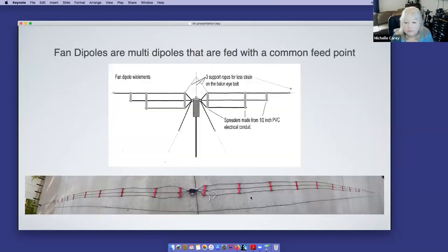I made one two years ago. You can see my spacers and the balun I bought — not one I made. This is a 20/40/80 antenna. You'll have to pick what bands you want. It's so easy to make — it was unbelievable. You hear stories about ham radio being expensive, but this antenna was under a hundred dollars. We used it at the SCARS field day two years ago for the go-to station and people were making contacts all over the United States, Canada, and Mexico. It works well and they're very easy to build.